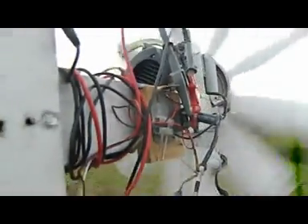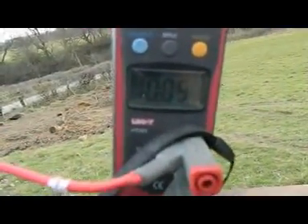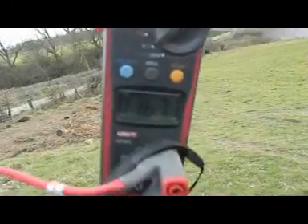We've got the machine spinning now — it's not too high off the floor, but obviously it'll be a lot higher when it's fully running. We've fitted some LEDs, and we've got a bridge rectifier and a capacitor there to smooth it out.